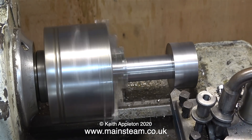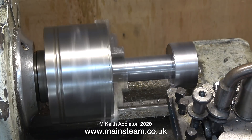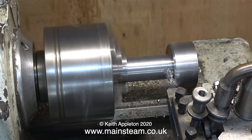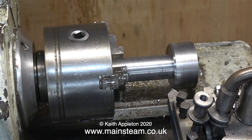Where possible it's a really good idea not to stand in the firing line of the chuck. This tailstock die holder is going to be a handheld device so I don't want any part of it to be sharp, and that's why I'm using this carbide tipped V-tool to create a chamfer on the edge. Always remember a 90-degree angle on a freshly turned piece of metal bar is razor sharp, so it's always a good idea to either chamfer the parts or at least use a file to dull the edge.